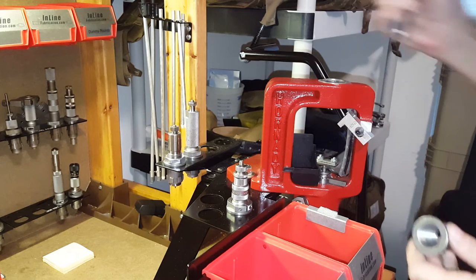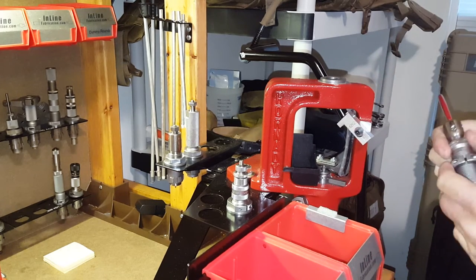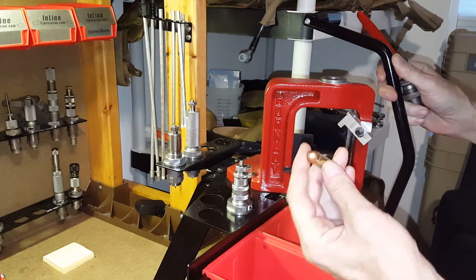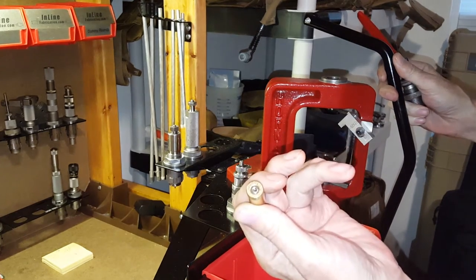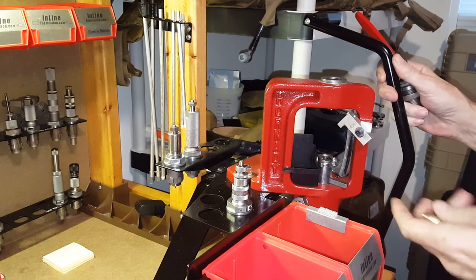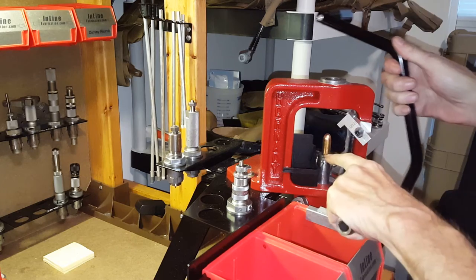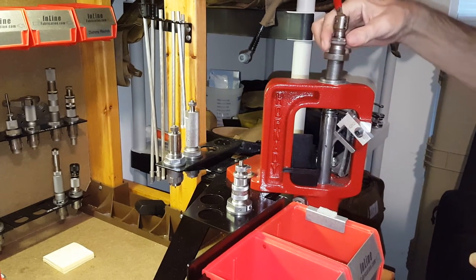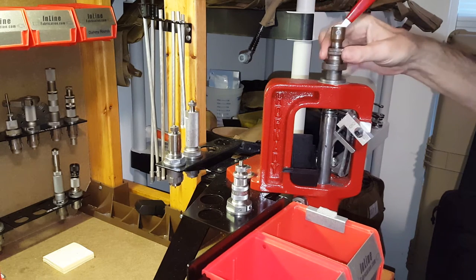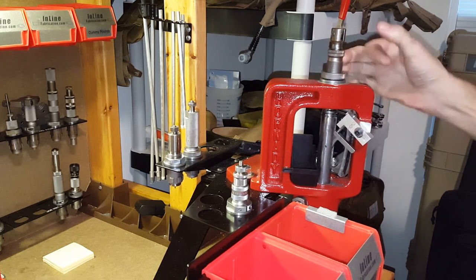To adjust the die into the press, I do this entirely differently than Hornady does — I put my Lock-N-Load bushing on there. By the way, I swapped these cartridges together just for this video, so some have a spent primer and some have no primer at all. What I do is take a cartridge I want to pull, raise the ram all the way, then screw the die down over the cartridge so it comes in contact with the neck of the case, then lock that down.